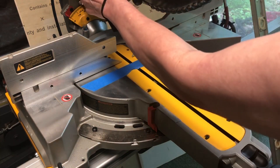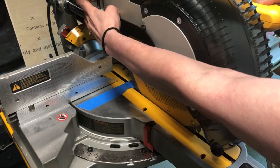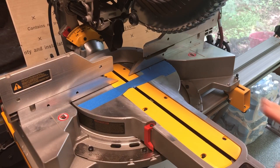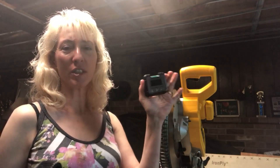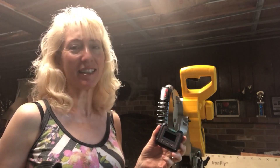When I got it, it was easy to take out of the box. The saw comes in the downward position with the miter pushed to the right, so I used the lever to adjust that. There's a little knob that took me about two minutes to find — you push the handle down a little, pull it out, and the blade goes up. I'm also going to be using an extension cord: make sure you have the right gauge and nothing longer than 25 feet to avoid power loss. Match it to the voltage in your house. I'm happy this magnetic square just arrived today — I'll use it to calibrate the blade, but first I'll do some test cuts to see how it's cutting since I haven't plugged it in yet.